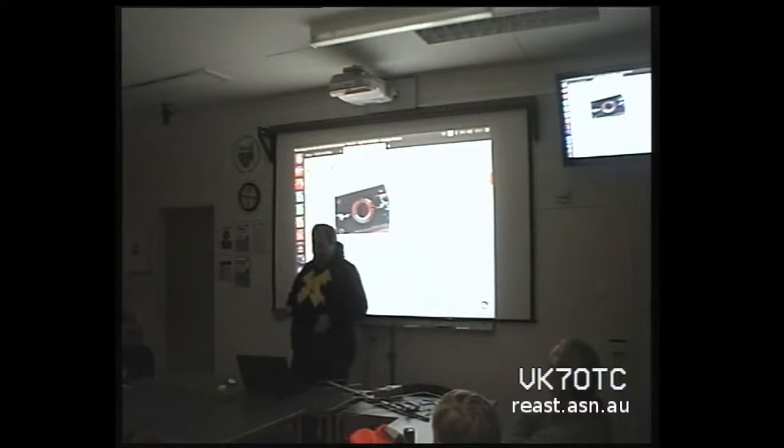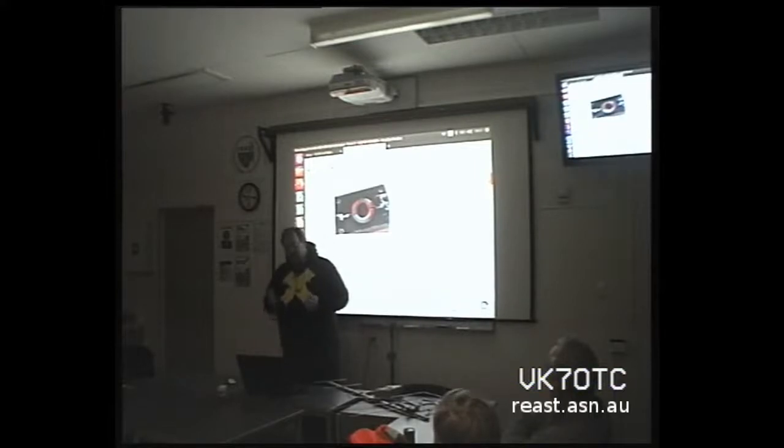So that was a bit nervy for me, because everything had to be just right. But I was really surprised when it worked. At the time when I was testing it, I had one of the antenna analysers by VK5JST, which was just giving you an SWR reading, and I'd scan the bands, every band. Steve's holding it up there now. And everything was under an SWR of 2, which is, for me, good enough when you're out portable and want to achieve a no-tune antenna.